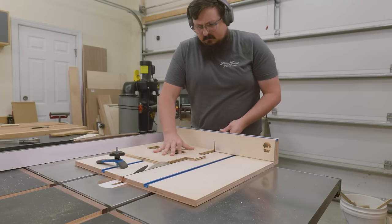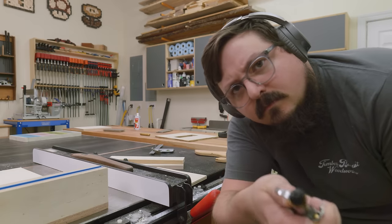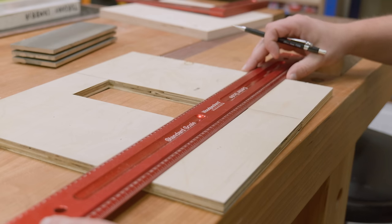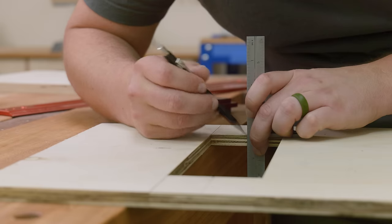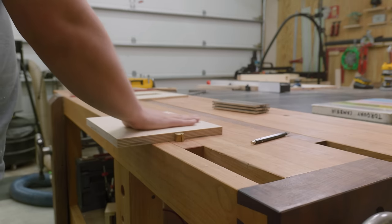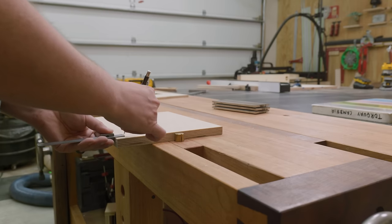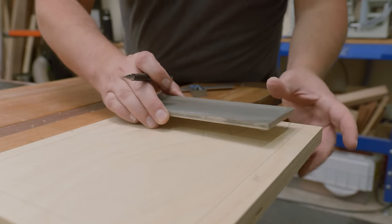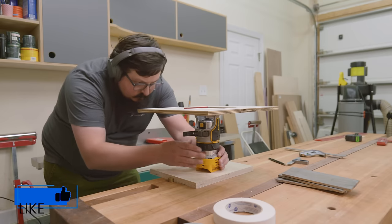Once the glue is set up, I could bring the piece back over to my table saw and use my crosscut sled to trim off that extra tab. Then I can mark out the center of my template. When marking out the center of a template, it's important to wrap the lines all the way around the inside of the template — otherwise when you go to line it up, it's going to be a lot more difficult to nail the position. Then from there I can take my plate panel and mark out the location for my plates. I'm going for a 3/4-inch border all the way around my plates, and between the plates I'll leave a half inch. If you're enjoying this video and find it helpful, please give it a like — it allows the video to spread to more people and I greatly appreciate your support.